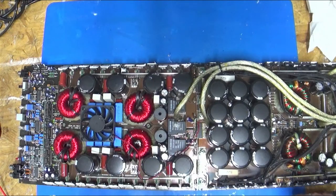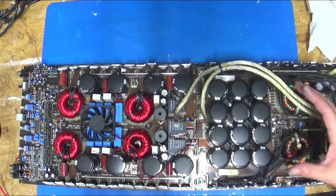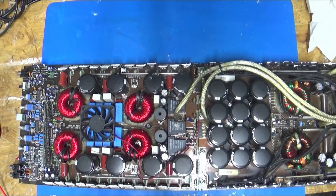the power supply toasty. The reason why power supplies do this, toasty, by the way, is because when they go dead short, if you don't have proper fusing or if you have really big fuses, you are now taking the full power of that battery and running it through this circuit board, and that's why it melts all this stuff. It's because your battery can basically arc weld, really, really high current. Yes, I know it's only 12 volt, low voltage, but it's capable of providing hundreds upon hundreds of amps, especially when dead shorted. And so it will just burn up these traces and burn up these FETs.